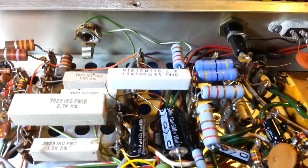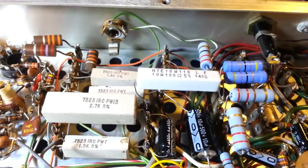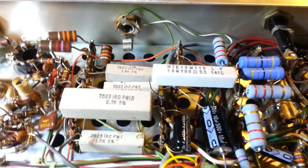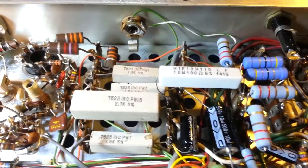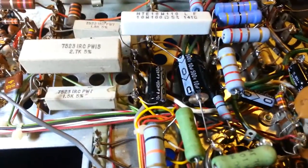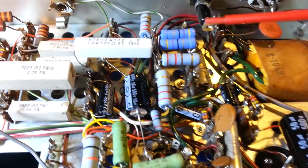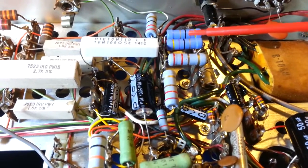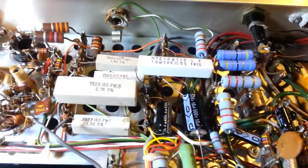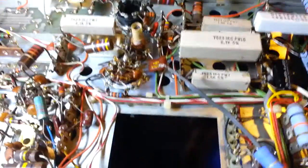The problem with that is it raises the high voltage throughout the entire radio, and you have to remember the entire radio circuitry was designed around a specific voltage coming out of the power supply area of this radio. If you go messing with the high voltage here, you're affecting it everywhere in the radio, and you don't know what adverse consequences that may have. It's not uncommon to do.